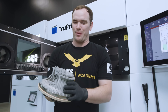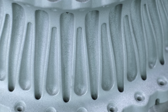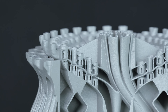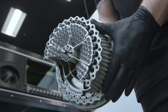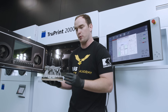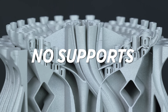Look at that — when I saw the model I was excited, but holding this thing it's a whole other level. It turned out so beautiful. On the front we have a cutaway to show the complexity of the inside geometry, but make no mistake — if this cutaway wasn't here, this would be a fully functional injector head. It was only made possible using algorithmic engineering and Hyperganic's core platform, and we were able to optimize our parameters on the TruPrint 2000 and print it with absolutely no supports.